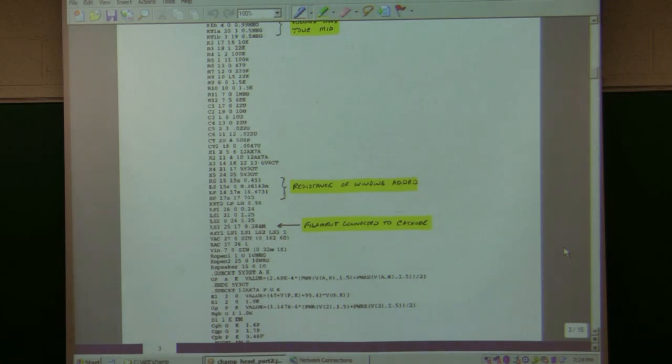I ran ideal transformers, measured stuff, compared it. When I had tighter modeling, if I want to put this in, I got better results. And then I also included down here a thing called mutual inductance, and that too plays a role in distortion. I'm a little surprised at that, but with SPICE you can take things out. You can make something perfect. So you measure something, measure the parts, and simulate them and measure the results. And when they don't agree, then I begin to put in more modeling and try to get the thing a little bit more refined.